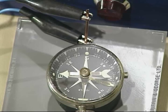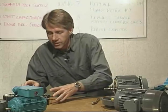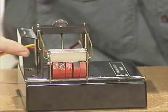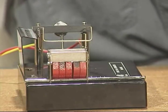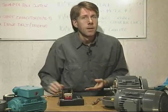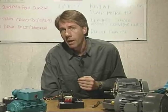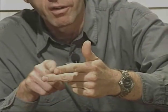This can be seen by placing a compass close to a conductor and switching the supply on or off. In this demonstration of a simple motor principle, a conductor is placed at rest in a magnetic field and the current switched on. We can see that the conductor tries to move out of the magnetic field. The direction of this movement is determined by Fleming's left-hand rule. If the first finger is pointed in the direction of the magnetic field and the second in the direction of the current, the thumb indicates the direction of movement.